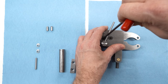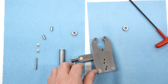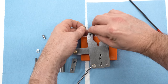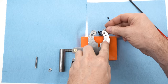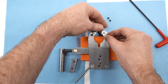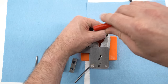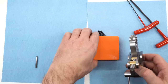Now that I've run the cam back and forth a couple of times and let everything settle into position, we'll tighten down the screws to hold everything in place. Next up are the knurl wheels. It's a little bit awkward because the boss is sticking out, so I'll set it on a box, slip the knurls in, slip in the pins, and then fit the pin locks. This is a really fiddly operation - that 32nd inch wide groove is sort of hard to hit and the plates tend to move around when you tighten the screws. It is a neat little mechanism though - it looks cool and it works well, just a little bit fiddly to install. The M3 screws for this were also way too long and I had to shorten these as well.